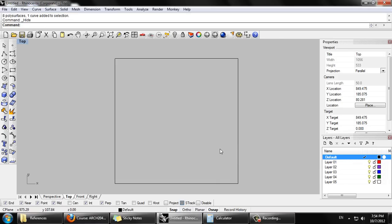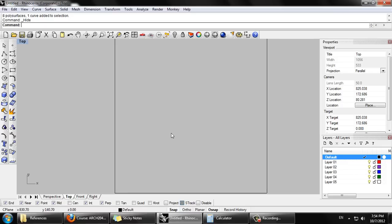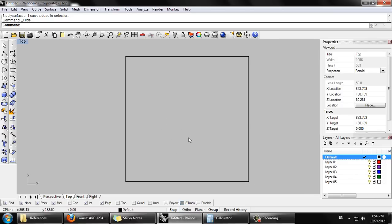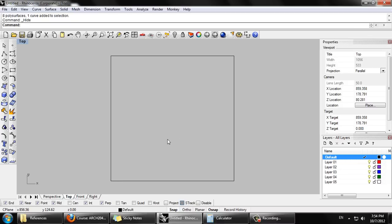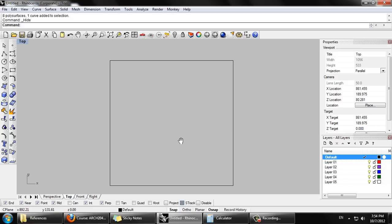For this next exercise, we're going to create a series of repeatable components using Rhino and output into the laser cutter, which we can then assemble into a three-dimensional object. We're going to touch on a couple of points such as how to properly export to the laser cutter, accounting for the width of the laser so that pieces attach or notch together seamlessly.